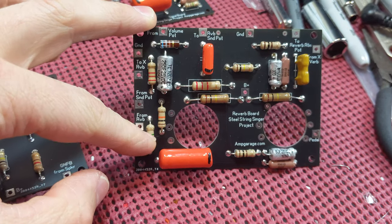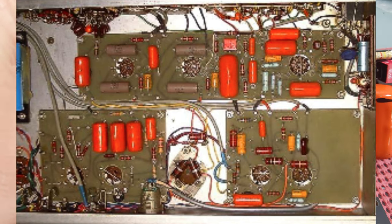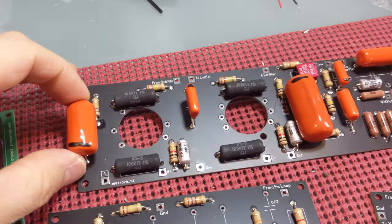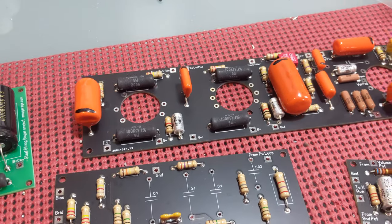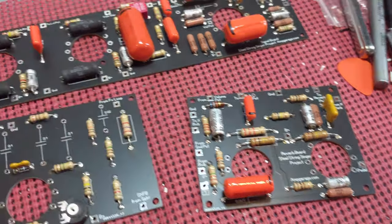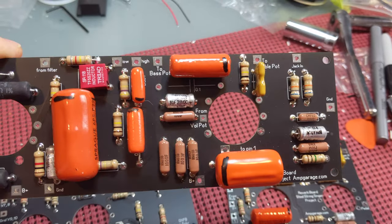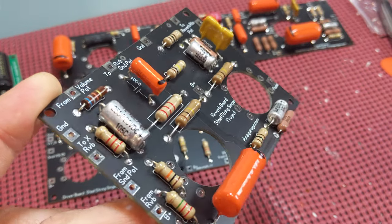I can't tell from the gut shot if the resistors are carbon composition as well — including the resistor up here. It says 100K on one reference but the schematic shows 270K. It's up for debate which is correct or like the real deal. I've simulated it and the tone difference is very slight, but I'm getting a way better sweep on the reverb with the 270K value, which feels right based on my ears. If anyone out there has an Oak Cliff Special, please reach out — I'd love to know your thoughts and compare against this build.